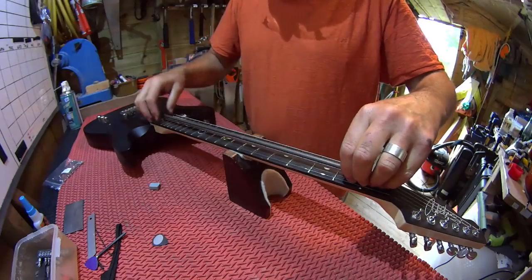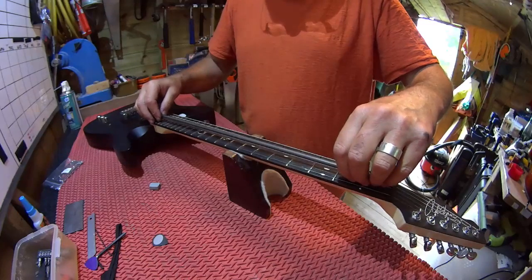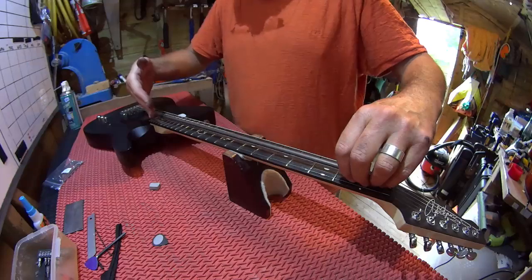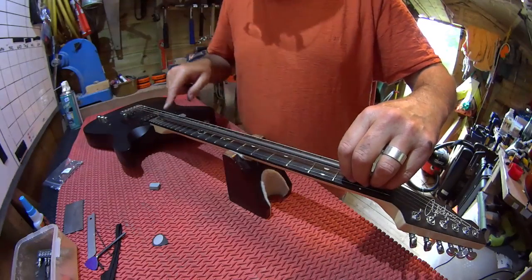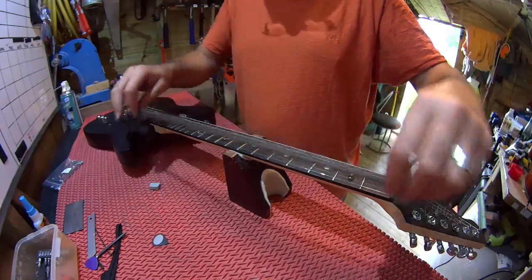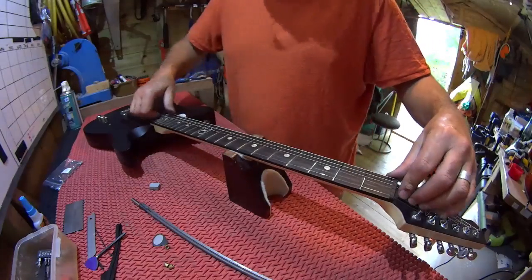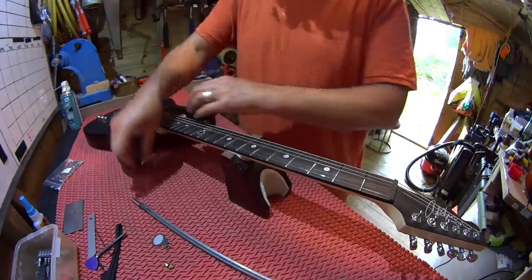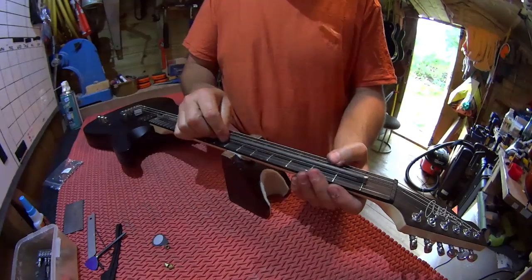And it does so because it's doing the leveling in thin strips, which when you cut a cross section in this direction, the radius difference across a tiny 3mm strip that this is working on is no different when you look at it lengthways, like a little slice. Now if you did it with a block, a wide block, that cuts in sort of 2 centimeters sometimes, that's too wide and it won't respect a compound radius.